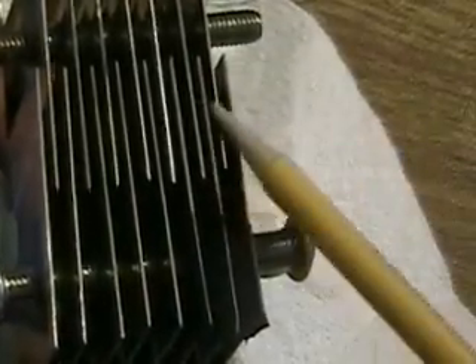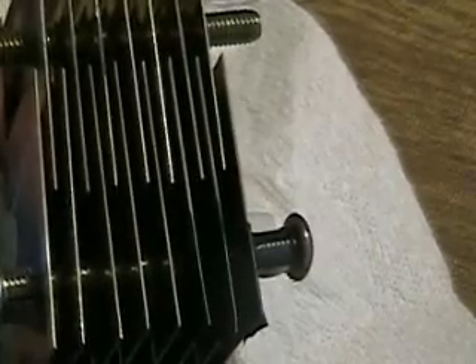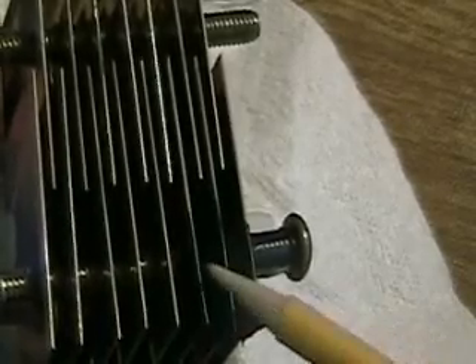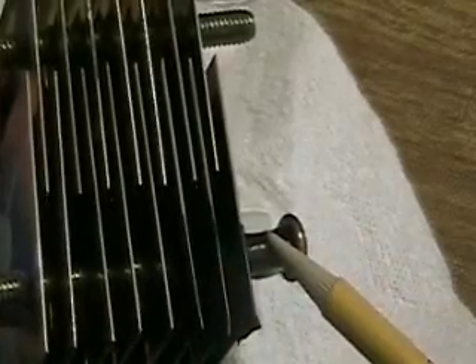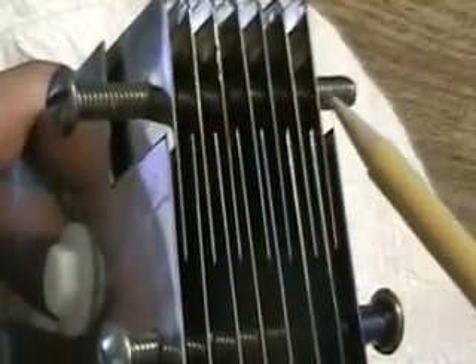It only has six plates essentially that are opposite each other — in other words, that are negative, positive, negative, and positive. The plates covered in tape are positive; all the rest are negative. So you have two electrodes — this one and this one, which are negative, going through all of these — and this one over here is positive. Why this is producing so much hydrogen I really don't know at this time. We could call it a reverse neutral plate system, if you want to coin a new phrase. This is the Aron Cell 15-plate system.